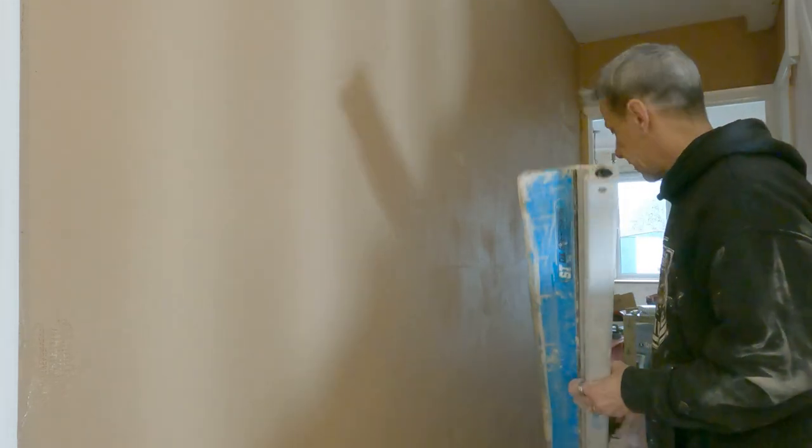So, that'll do. Let's second coat this up. I might have to knock down my gear a bit. Add a bit of water, loosen it up a tad. What's it like? Oh yeah, that's 250. We're going to put speedy up stuff in this. It's not going to hang about, is it? We'll normally put a bit too much water in to knock it back up again. Don't forget, if you're ever doing this, that it's going to go off a lot quicker, even still. Unless you've got extra time in it, which I've noticed, if that is starting to thicken up in your bucket, and you whip that down, it does stay wet for quite a bit longer than it normally would. And workable.